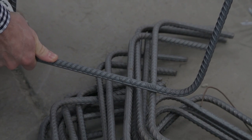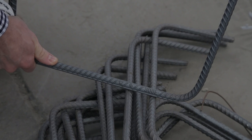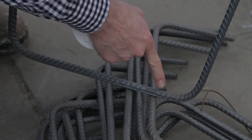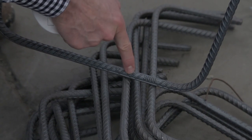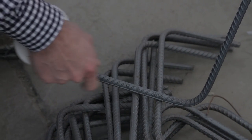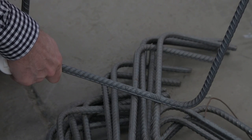Normally long bars are made of grade 500 reinforcement and say grade 500 with the appropriate marking. In this case you've got grade 300E, which identifies this as a grade 300 bar. Grade 300 is usually used for stirrups and doesn't have quite the same requirements for bending and handling that grade 500 reinforcement does.